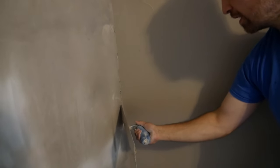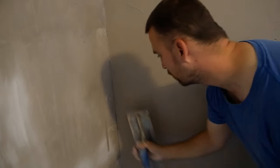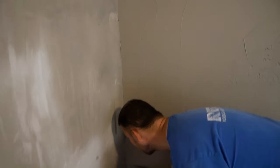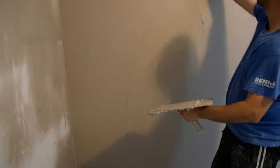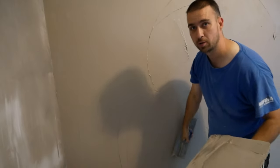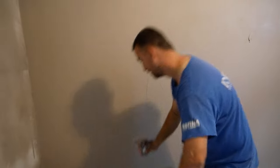When you come close, you'll see this wee bit on the end — try to clean them off as you go. Plastering is all about the angles, the corners, the beads and things. These are the real things that every person will notice. Just bring it under the wall and bring it all the way up. Make sure you go high enough where you're catching the top coat that you put on. Just chase those lines away so it's all nice and neat.